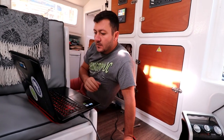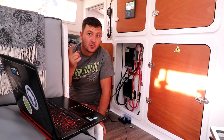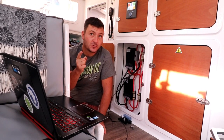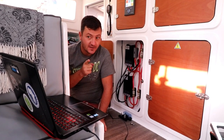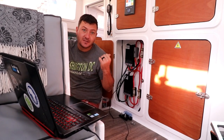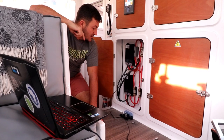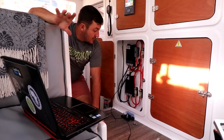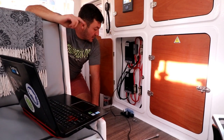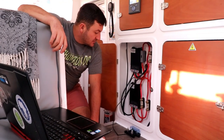So what are you doing? So two buck boosts installed and I believe that we are the first people to show this on YouTube of running a double buck boost system from two separate engines on a cat. I don't think there's anyone. I don't even think people install these. There's maybe one person that I've seen installing Victron buck boosts. With this system you don't change your alternator, nothing, and it protects our alternator because we limit how much current we're gonna put out of it.